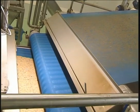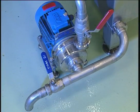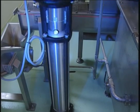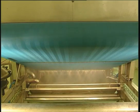The filter belts are continuously cleaned during operation. A circulation pump pumps the flushing water, which contains solid particles, to a rotating screen which continuously separates these solids. The cleaned water is pumped under high pressure to nozzle pipes with a pressure pump and is then recirculated back to the rotating screen and used again for cleaning the belts.